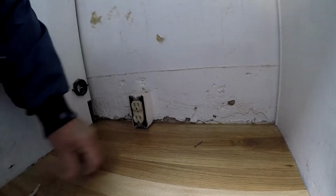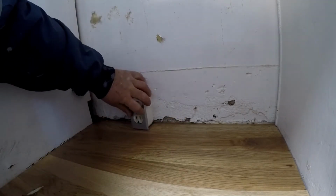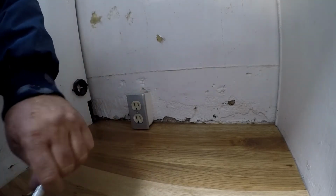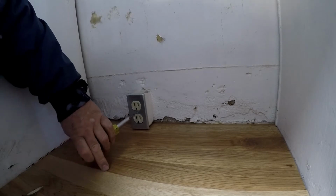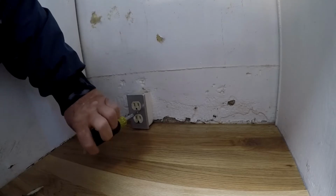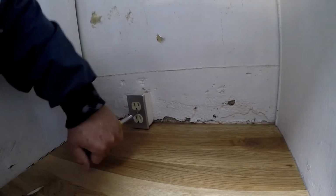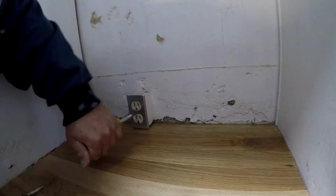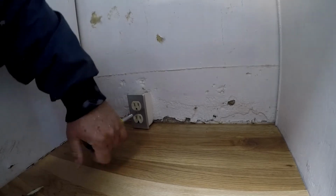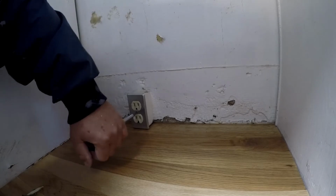Now the common practice that I use anyway is, we have a new metal cover plate, and it has a Phillips head screw on it. I run the cord through that hole in the cabinet to under the sink and have the dishwasher plug under the sink. The reason is that if you need to unplug the dishwasher for some reason, you can easily get to it under the sink.